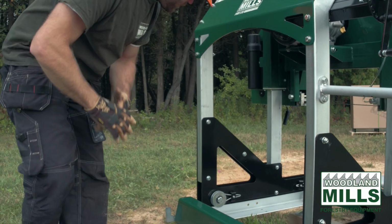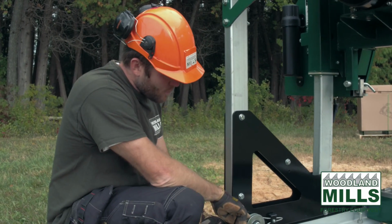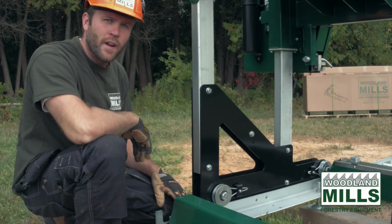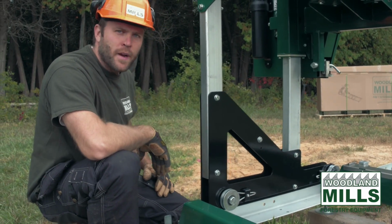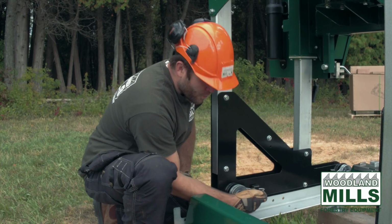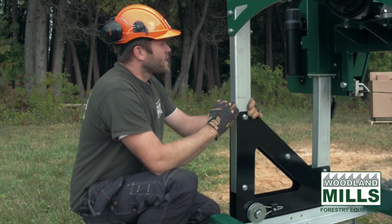I mentioned the carriage wheels. So the carriage wheels have a dual race bearing pressed into the wheel, and this allows a very accurate bearing to be used. We use a radius design in the wheel, but a square top in the rail. What that does is it basically locks the two together, and then they hone in to make a matched pair over time. The track sweepers are stainless steel wire, and they keep that groove in the wheel clean. They also give us a long service life because we can just push them further in as they wear.